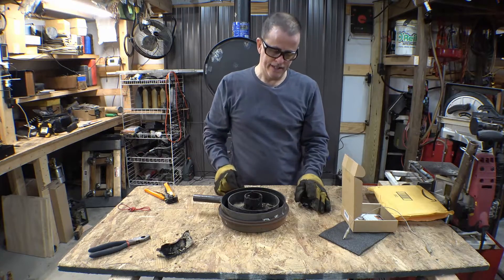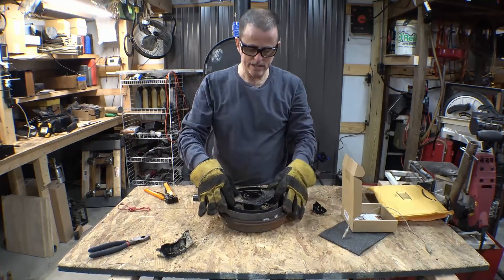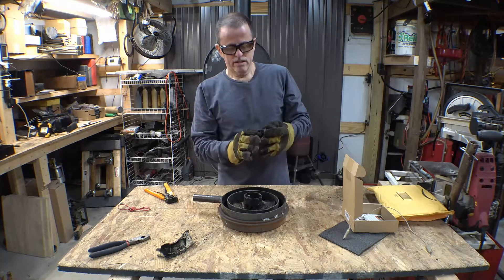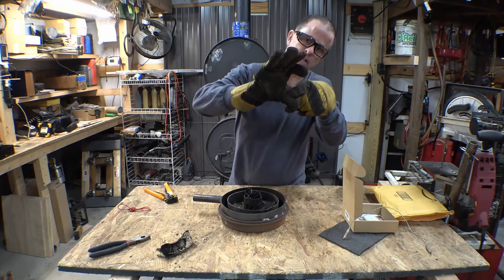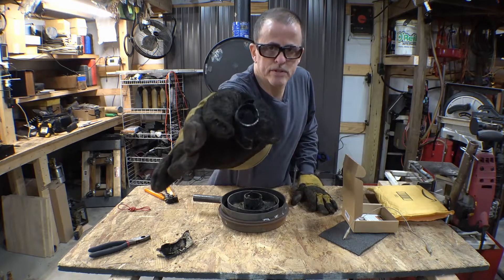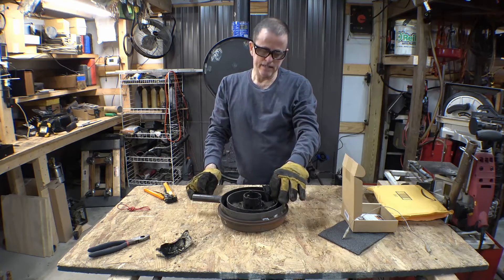You can check a link to my last video where I tested how much it burned. Another test that seems to work pretty well is this little tray right here — it angles downhill, sits right about here. Same thing: drip tube drips oil down on it, the air swirls around. What I found though is that the air seemed to move across it and cool it right away. So the next thing I tried was raising the oil tube up inside the air tube so it wasn't on the bottom edge — it's actually up in the middle now, so the air hits it and splatters the oil around. That ended up splattering oil all over the inside, so I made this little diffuser that goes over the end of the oil tube, set so it blows more of the air around that way, which lets this get hotter.